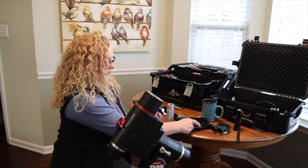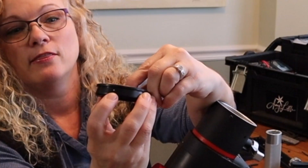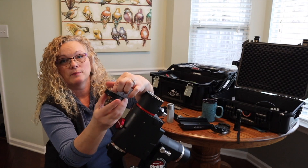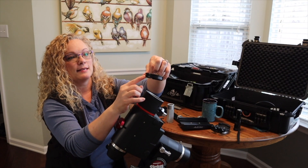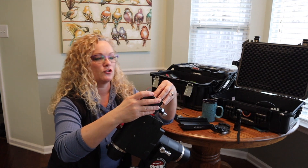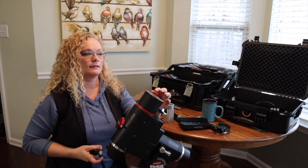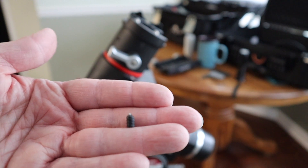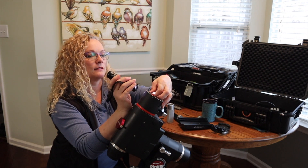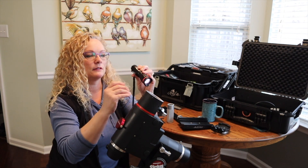The base plate just came right off. It's real small - I'll zoom in on this. There are three little indentions along here and this is where my grub screws are going to line up. I just need to make sure that I line these up with where the grub screw is. I put this in and it just dropped right in there. I need a flashlight for this one - I've got one grub screw that is completely removed. It may have sat in a little too far, not a big deal, I just fish it out a little bit.